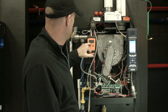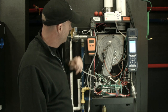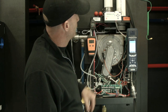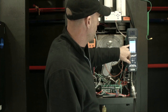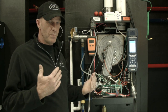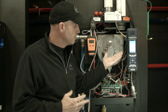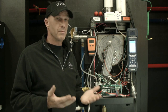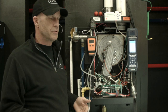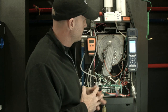As we're doing this, we're going to watch our gas pressure climb back close to where it was. Checking static gas pressure — at 7.7 inches. Not a huge change from ignition even to low fire. Holding steady on fan speed and watching the CO and CO2 come down. The CO2 should change very slightly from high to low — we were close to 9.5%, so coming down to low fire I anticipate seeing around 9–9.1%. What you really want to avoid is having your low fire CO2 above your high fire CO2. If you see that, that's definitely going to require a manifold pressure adjustment.